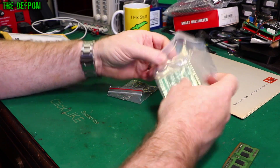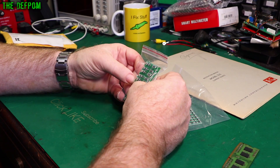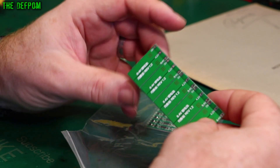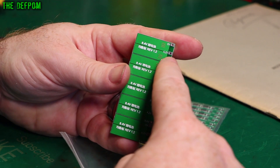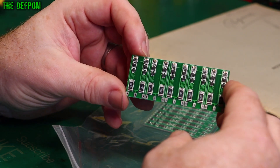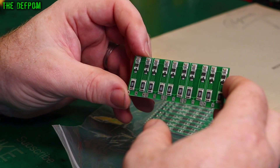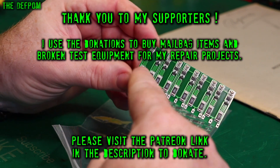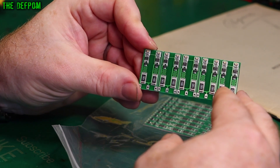What we've got here are some balancing boards for lithium cells. I've got two types here. This is a panelized version of five boards - there's five separate boards on here. 0V, 4.2V and 0.4V. What you do is put these across the cell pack and you can use that to balance the cells. This will mainly keep them in check with each other, otherwise you might end up with one cell being overcharged and the other cell could be almost dead.